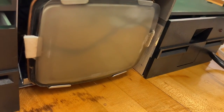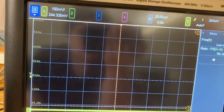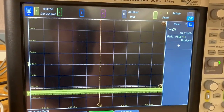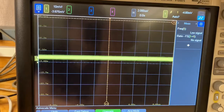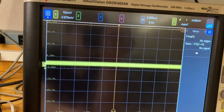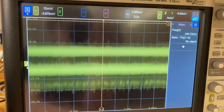I think this thing is trying to give us video output, which means we're one step closer to debugging. It isn't a problem with the processor. I think it's a problem with this dinky little CRT. There are also some other signals here — brightness high, brightness low, and brightness arm. I don't know what these things are, but we can figure that out later.